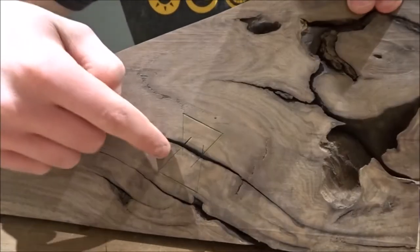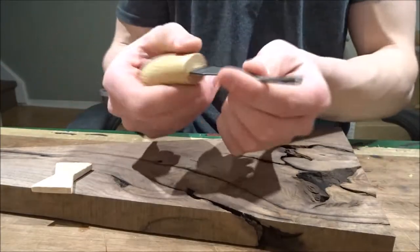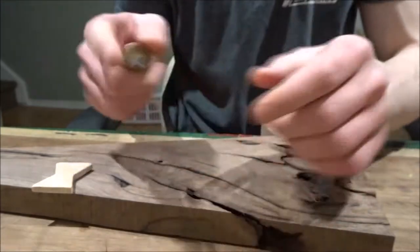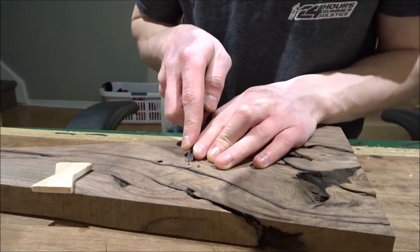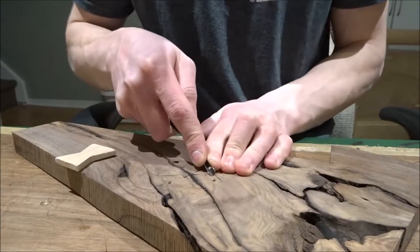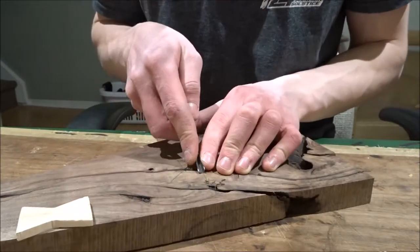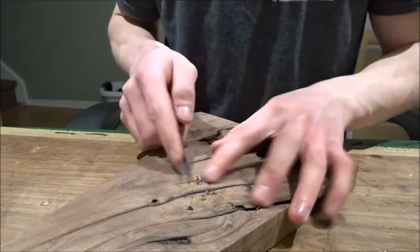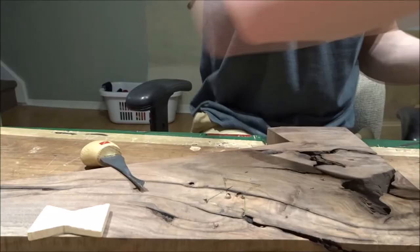Next thing you want to do is trace the exact same shape right onto the piece of wood, after you've smoothed out the edges of course. Once you've done that, you want to find either a V tool, kind of like the one I'm just showing you now — that's what you're going to want to carve the edges out with. You could also just use a normal chisel, or in a minute I'll show another tool I use. Basically what you want to do is carve out a recess for the bow tie to go into, in the exact same shape as a bow tie.